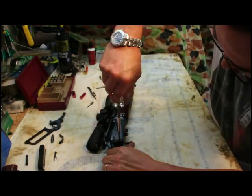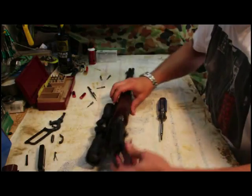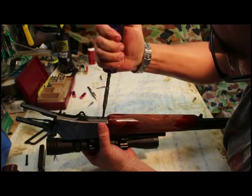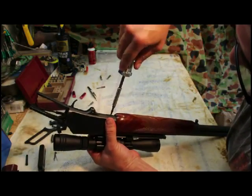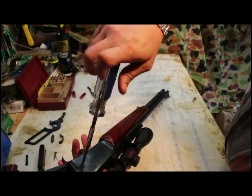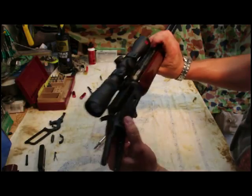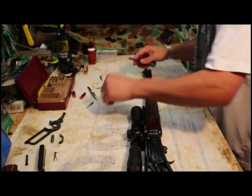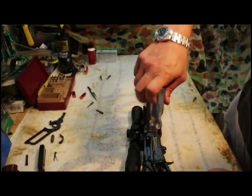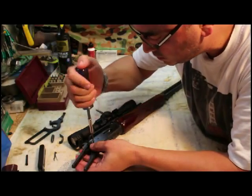Give it a good snug. Now we snug the other ones. The hammer pivot screw is the one that could do with a little bit of removable loctite — the other ones don't really need it, they don't have a habit of coming loose. The last one is the shell carrier pivot screw and that's the one we're going to do now.